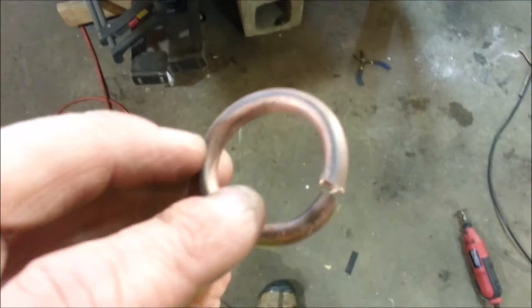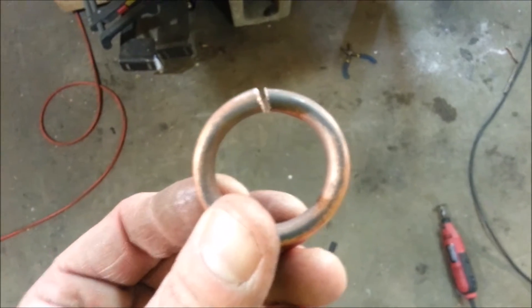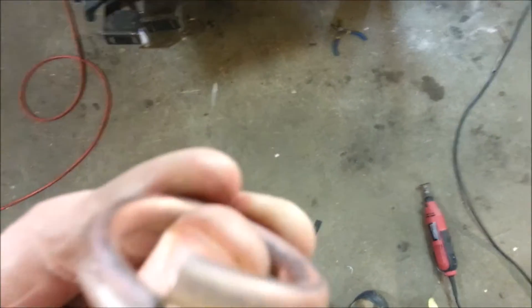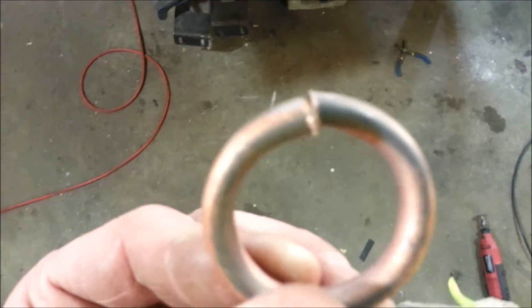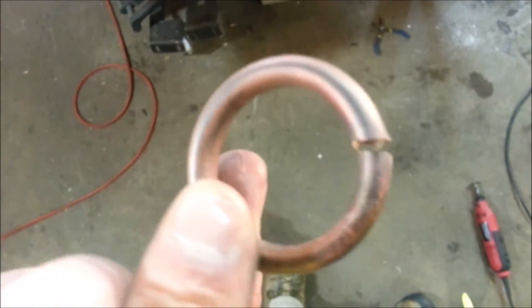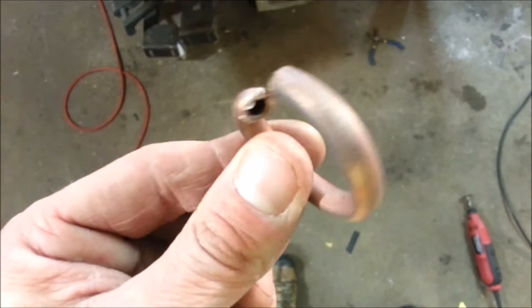Because now that I've already bent this into a coil, the copper has re-hardened. If you haven't ever worked with copper before — if you heat it up to a point where it's nearly red hot, or better yet red hot, it will become really soft upon cooling and can be easily worked. But the moment you move it, the crystal structure realigns, something very strange happens — it instantly becomes hard when you bend it. You have to have held it in your hands and bent a few pipes to know what I'm talking about. So I'm going to heat this up with a torch before I attempt to bend that seam together.